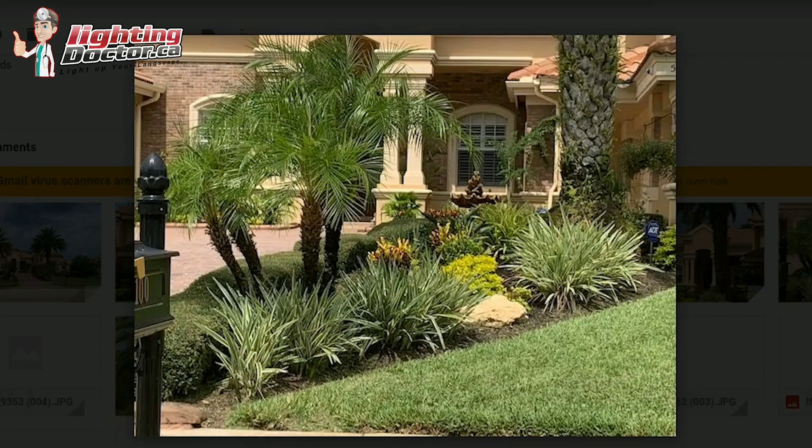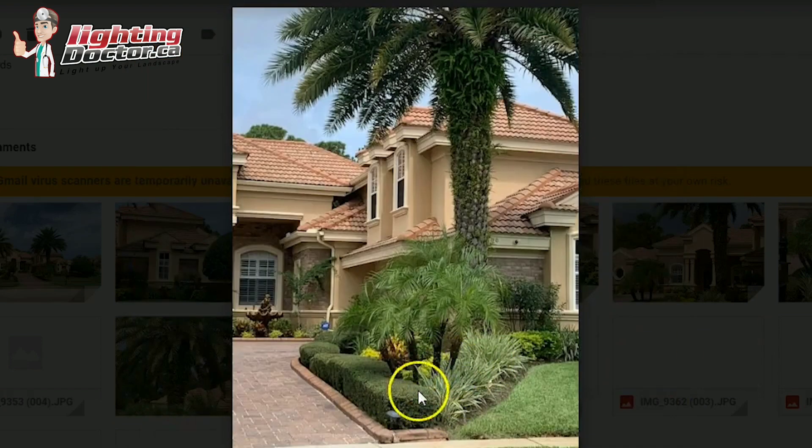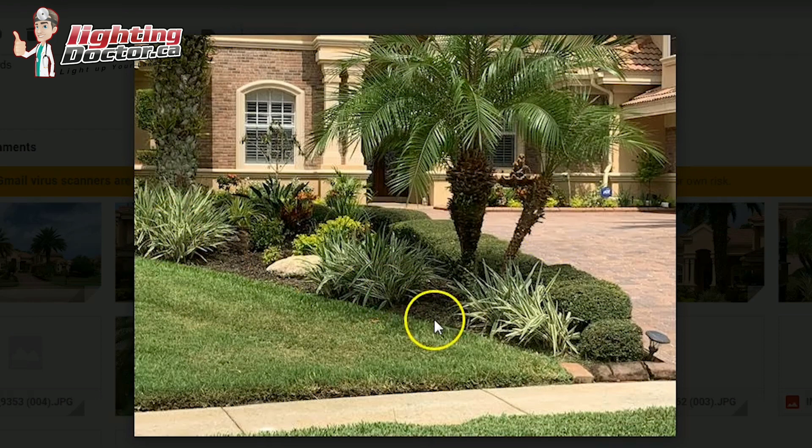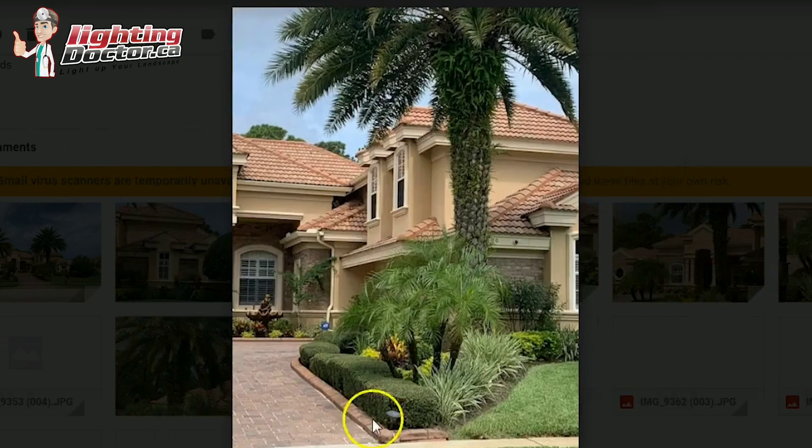I would also try and highlight these smaller palms in the front. With a standard accent light at the base, I would try to highlight a couple of those. You may want to throw two to catch both of those branching structures. I would probably try and do the same back in this palm — really focusing in on the palm trees there. On the other side, I would try and throw two at different angles so that you catch all of it. Keep in mind you don't necessarily need to put more light down here because you're going to get a little bit of reflective light just from having these up lights.